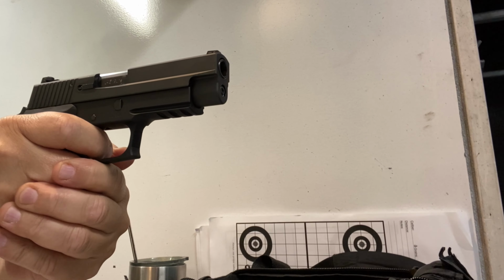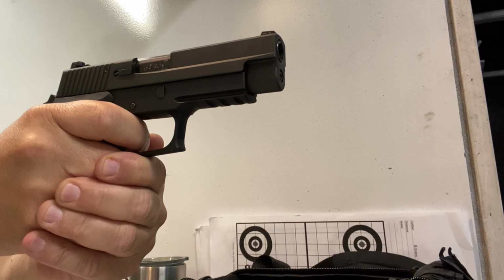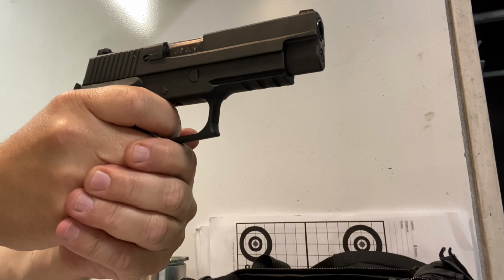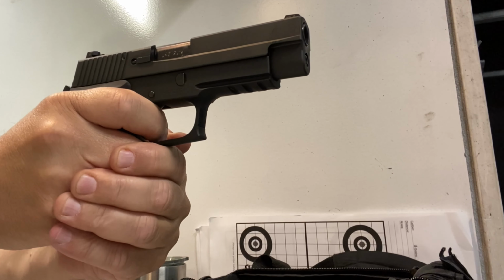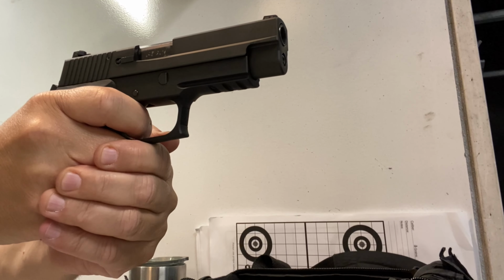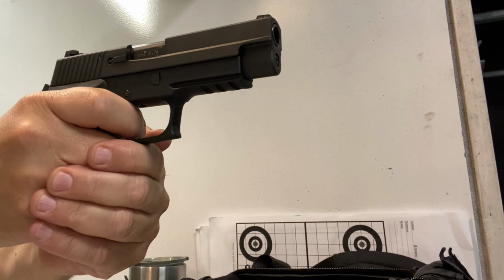This is interesting. I can't even get into this without the stuff to show you, but there's an interesting connection here with the 210. The 210 was a licensed copy of the French model 1935, which is the Petter Browning design. Petter had removed the loose-fitting barrel bushing and the tilting link of the John Browning M1907 design, but retained the grooves on the top of the barrel, which engaged similar grooves in the interior of the slide. Sig licensed this design in 1947.